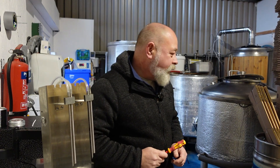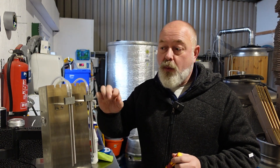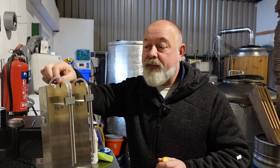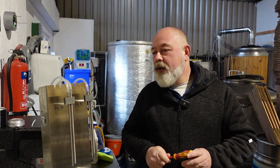We could filter, we could do some other things to improve that yield, but at the moment that's how it is. The problem I've got is this is buggered again. It's a great piece of kit, but it's not designed for thousands and thousands of cans and we've been absolutely hammering it lately. I'll show you inside in a minute, but essentially I've got to replace one or both of the beer delivery hoses inside because they've become a bit hard and work hardened. So I've got some new hose — we're going to get that in and then make sure we can fill before we start filling.